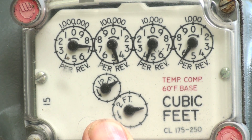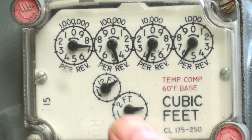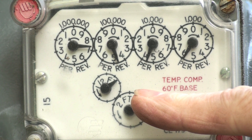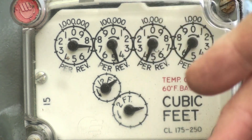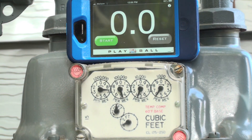If you look closely at the two-foot dial, there's an arrow that tells you which way the needle moves. You want to time one complete revolution — all the way around once — and you're going to time it from the upswing of the needle. If it's traveling counterclockwise, don't start on the downside, because these meters have little plastic dials that are kind of loose. When the weight of the needle is on the gears it'll be accurate, but as it goes over center it kind of jerks going down.